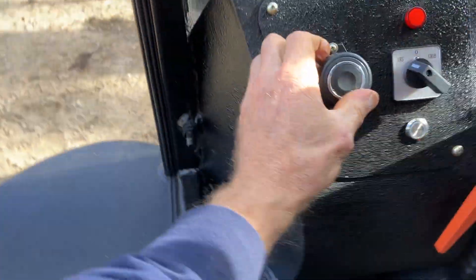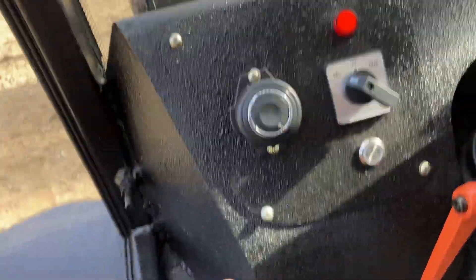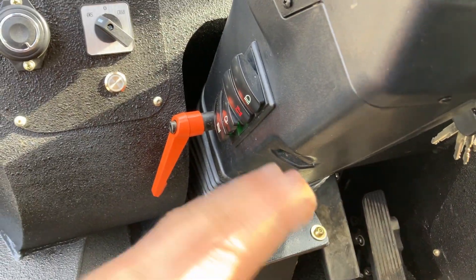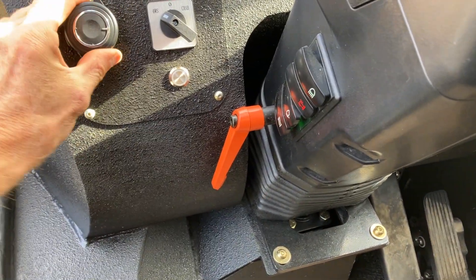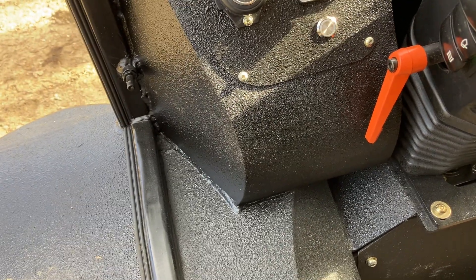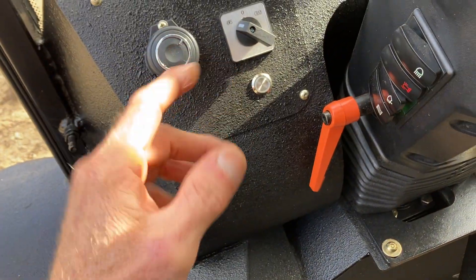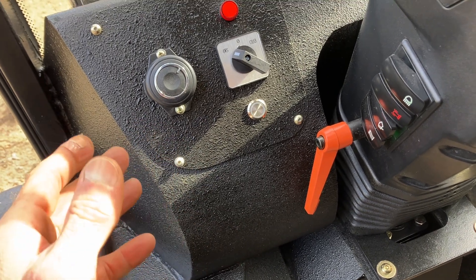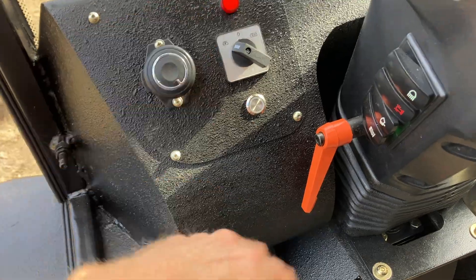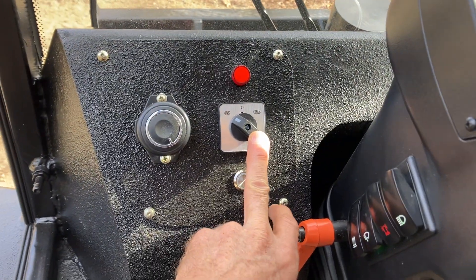You've got hand inching, so for speed you have it all the way open for maximum speed — it's just going to do whatever your throttle says: more throttle, more speed. Or if you turn your inching down, it doesn't matter even if your throttle is all the way open — it's still going to restrict the movement and slow it down. So if you're doing something with precision, you can use your hand inching.